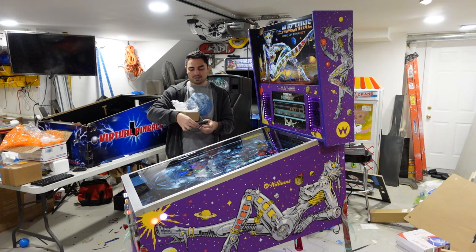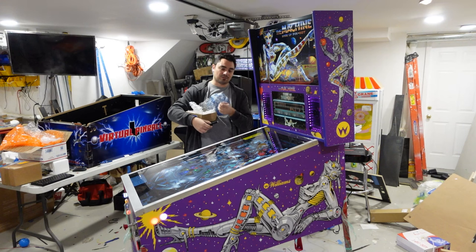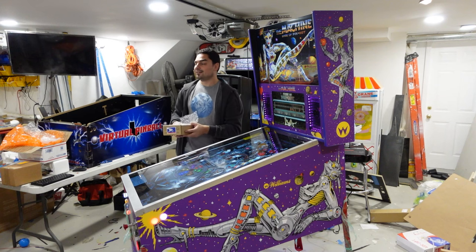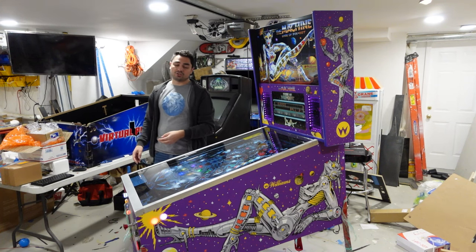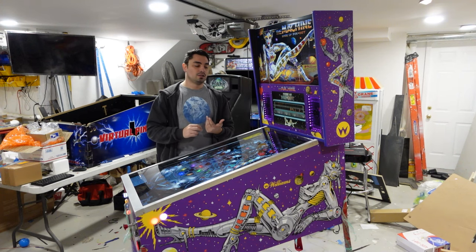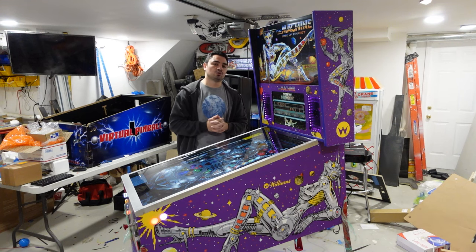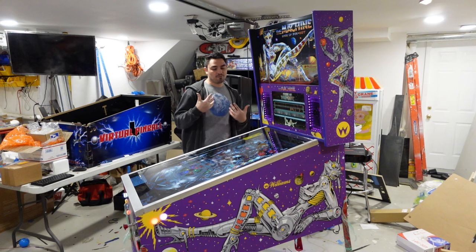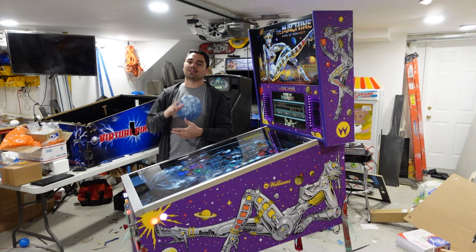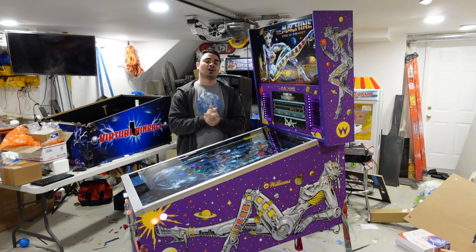Honestly, it's a big piece to virtual pinball. Again, getting that analog plunger and also the KL25Z for your nudge, it's a thing of beauty. Mentioning real quick, the nudge, very important. Not many people know the secret to it. When you do have a shaker motor, you want to mount your KL25Z board to what I use, an actual drone vibration plate. I have all my cabinets, Project Canada's, this cabinet here, for example. The KL25Z board is not hard mounted to the wood that's the base of the cabinet. No, no, no. It is actually on a vibration plate.